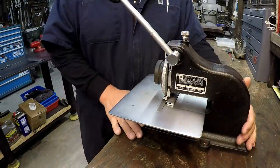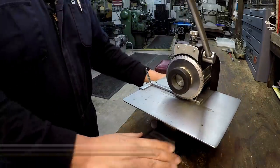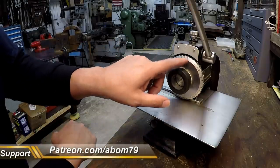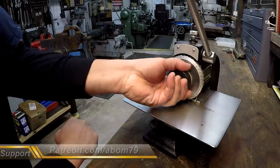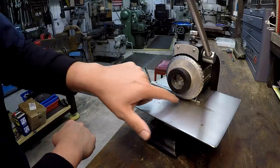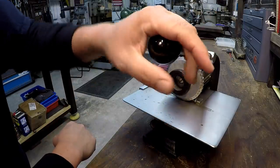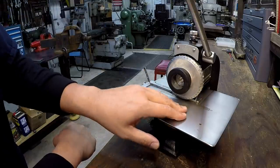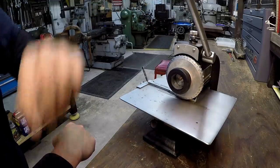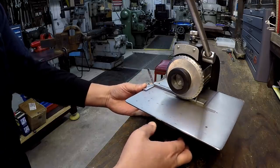We'll take a quick look at the Schmidt marking machine here. This was something that I picked up off eBay. And you have a dial here with whatever letter numbers that you want to stamp in the thing, and you just simply rotate it around. You line it up on the top to indicate the letter that you want to stamp on the bottom there, okay? So to stamp it, you just pull the lever down, and every time you pull it down, the table moves over one division, just like a typewriter. That's how it's set up. You've got a button here that you can use to release it or position the table over where you want it to go.